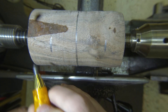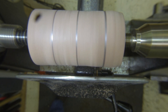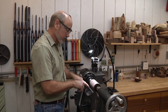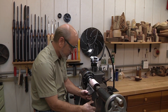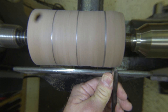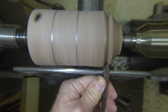What I want to do right now is move this wood out of the way so we can use the jig in a second. I'll turn this on and make my marks. You can take a big parting tool, whatever you want — I'm actually going to grab a spindle gouge, a little teeny meeny miny moe one. When you're turning, you don't want to leave a big gap between the wood and the tool rest because it induces more vibration, and if you get a catch the tool will fall down in there.